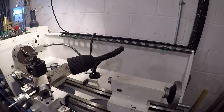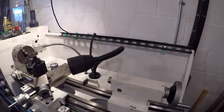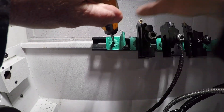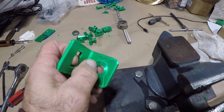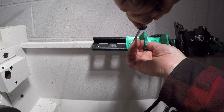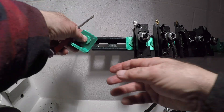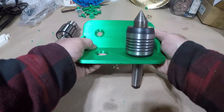I got the unistrut installed using those 60-degree wedges — I just bolted the unistrut to that lip on the back of the lathe. These things are working just as I intended: easy to install and easy to adjust. I made a slight adjustment to the holder so it can also accept my chuck key and my wrench.